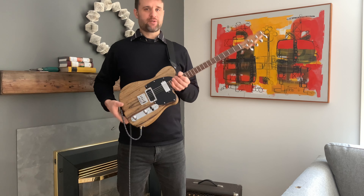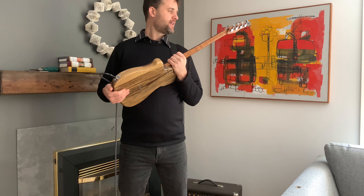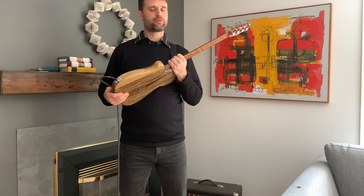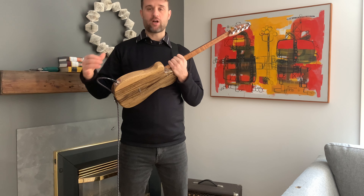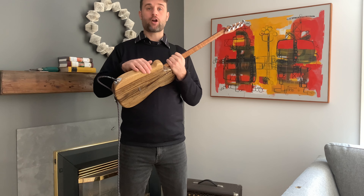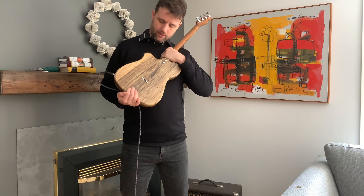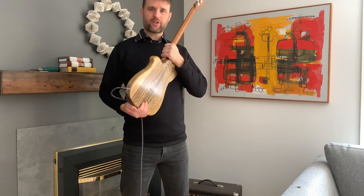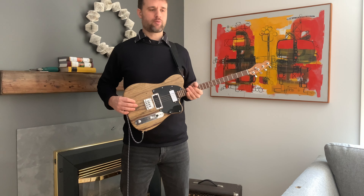The body is a little different from what I usually do. This is called Black Limba. It's kind of in the mahogany family of trees — a different family — but it looks and sounds a lot like mahogany and works similarly. It's the same Janka hardness rating, but it has a different tap tone. Mahogany usually has a bump in the lower mids; this has more of a bump in the higher mids, so you get a little bit more presence from it.